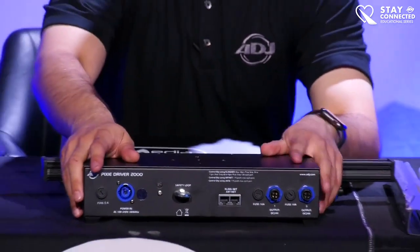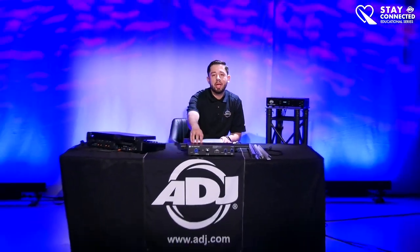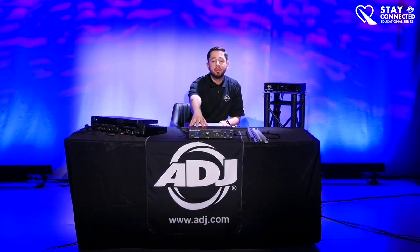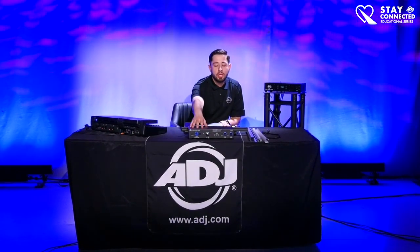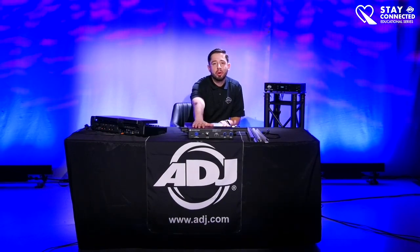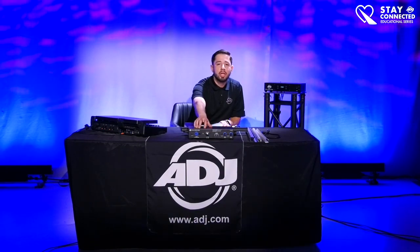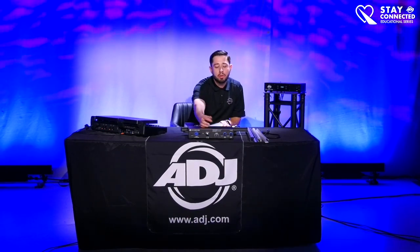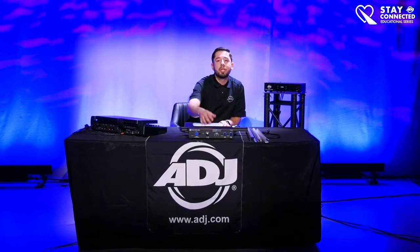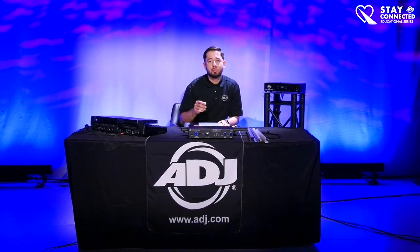The great thing about these is directly out of the box, or should I say directly from your computer to the driver, you'll be able to link a total of 5 units. Each unit, whether you're running Kling-Net or streaming ACN or ArtNet, of course they're going to vary, but with Kling-Net, you're looking at 1,000 pixels per port, hence the name 2000, so it's 2,000 pixels in total. If you're going to be running streaming ACN or ArtNet, you're looking at 170 pixels per port.